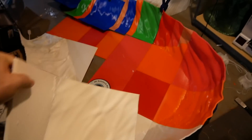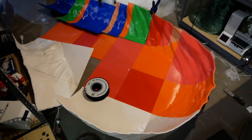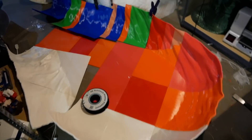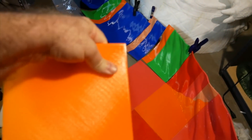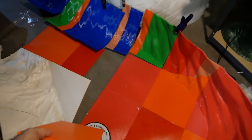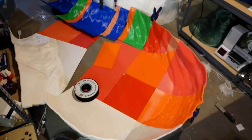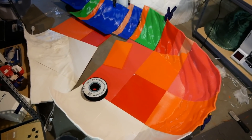I discovered — I'm still a little unsure about the root cause of this, but it seems that if I print slower and hotter on these sort of horizontal pieces, they come out fine. To give you an example, this section right here — it's just a rectangle, but it's super strong. I can squeeze it with no crackling. I'm not gonna try too hard to break this, but it doesn't really have any kind of give at all. So that's the final version here that I ended up with, but I did have several times where I just had weird breakages like the one I just showed you and it got me a little bit worried, but I did eventually find the solution.